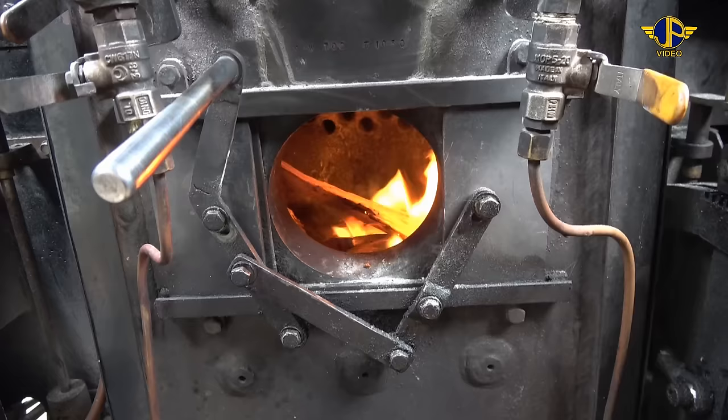The device on the side of the cab here is the hydrostatic lubricator, which lubricates both side cylinders. Inside here is a condensing chamber where the steam comes in, condenses to water. The water then flows down a tube, pushes the oil up to this pipe here, which feeds through to these two valves, one for the left hand and one for the right hand cylinders. They're just opened up to allow steam then to take the delivery of the oil from the lubricator sight glasses, down through the point of delivery to each side cylinder, so it lubricates the valves and the pistons in the cylinders. Okay, we've got to make sure that we've got steam oil inside the lubricator.